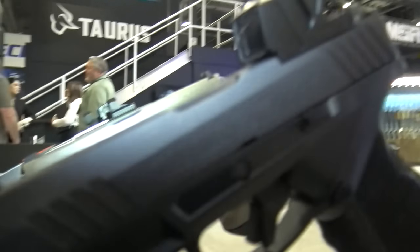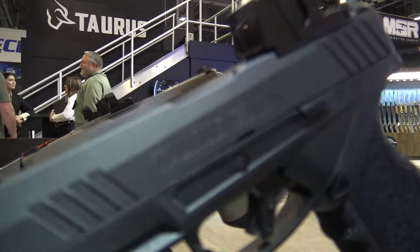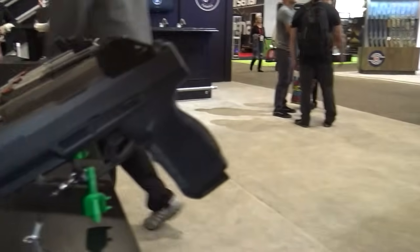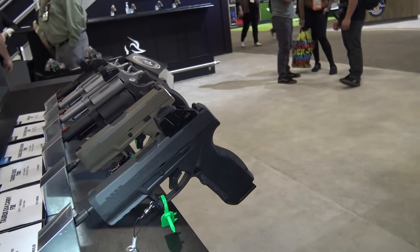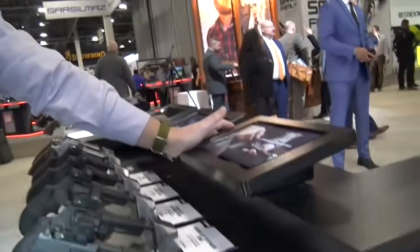So on some of the very early production guns, the chambers were a little bit shallow. So if the round was loaded long, or the OAL was a little bit out of spec, or just slightly different from like mass market American ammo, you would have issues with the gun going into battery. Can I go to your website and know which generation I have, and do I have an improved version? Is there a way to know that on your website? Not on the website, because it was something that was corrected very, very quickly. If your gun doesn't go into battery with certain brands of ammo, send it back to us, and we'll send back a repaired one. Has it been a problem or no?